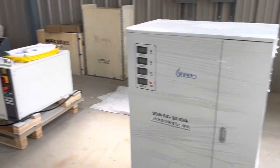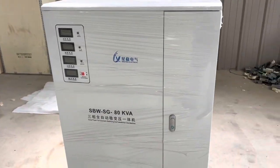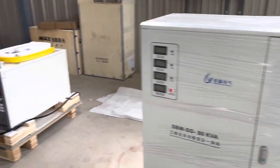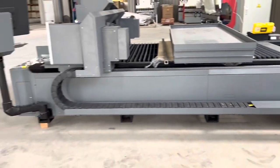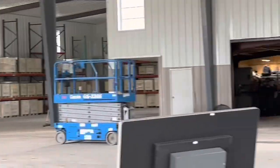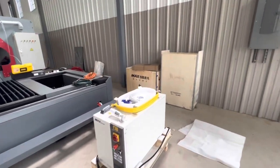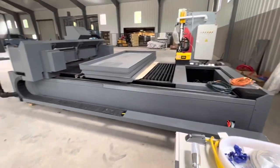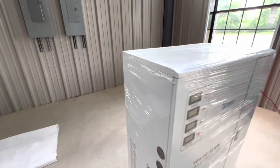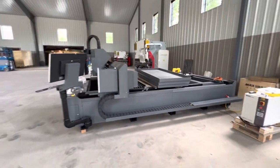This is an 80 kVA unit — plenty enough to run this machine. 240 volts in, 380 volts out. And if you have 208 or 480, I've got them for you. If you look in that room, we've got a ton of transformers and stuff. We've got a little bit more to do finishing this one up, and then we'll get our three-phase connected and fire this bad boy up and show you some demos of that running in the next video.